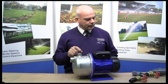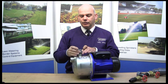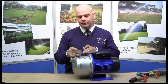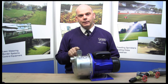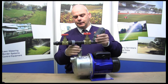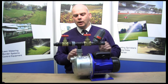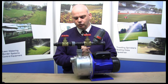We've got a one inch outlet on this one. I'm using plastic fittings here, though if you want to use galvanised fittings it's pretty much exactly the same. Some of these have got seals so you won't need PTFE, but the galvanised ones obviously you will. So I've changed that from a female to a male fitting and I've got this arrangement here.